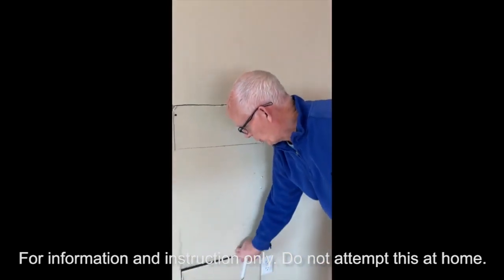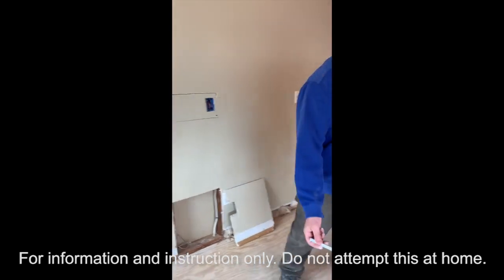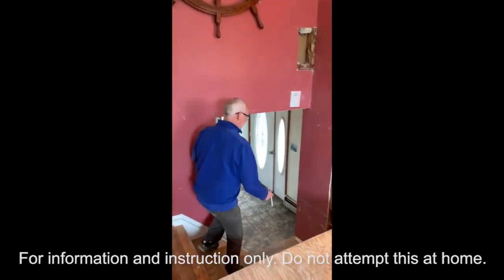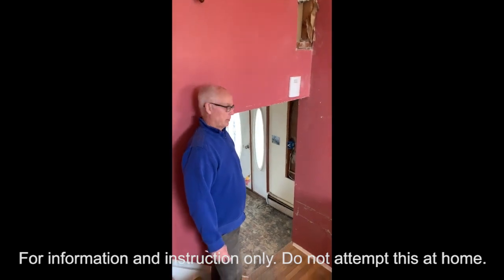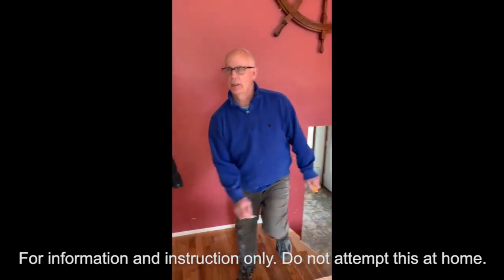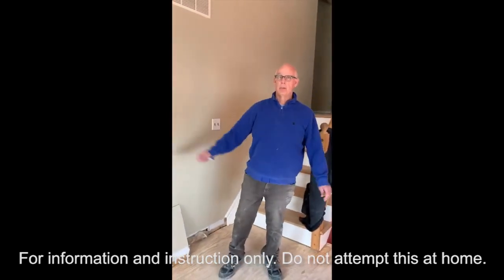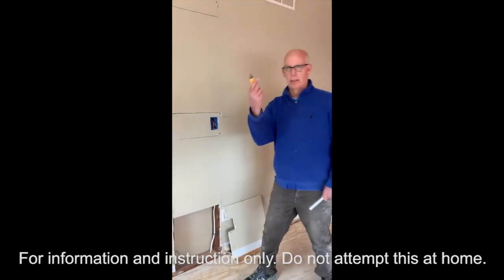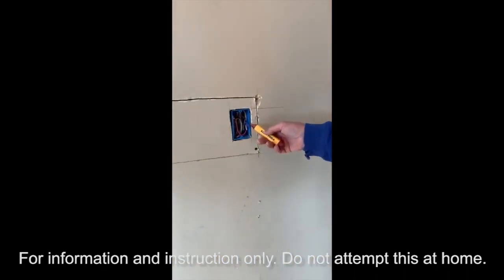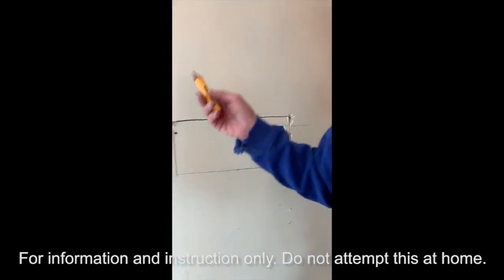I had to open it up here, throw a hole, and put the wire across the crawl space out towards the front door so there are two different locations to turn the switch on from. They call it a three-way switch because it has three positions — up, down, up — or up, down, up from the other side. I'll demonstrate the electrical tester: it's turned on right now and you can hear a beep beep beep with the red light, meaning it's hot.